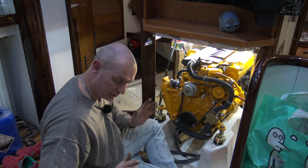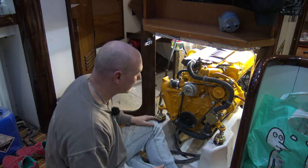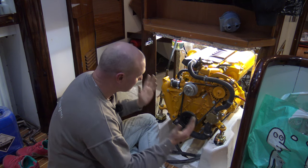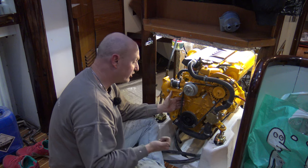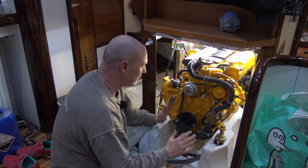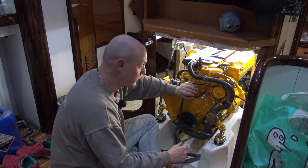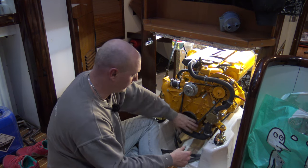I think I will, now I have removed the cover, I will leave it away. I will never mount that again. So every time I open into the engine, then I can immediately look at the belt. And I can see if there is any damage or it just needs to be tightened up or something like that. And that is very important because up here we have the cooling water for fresh water. Over here we have the alternator. And down here we just have the engine.